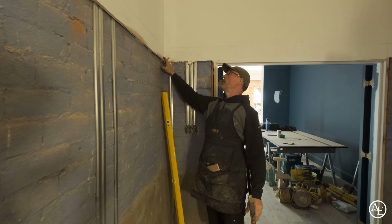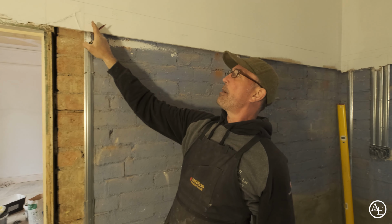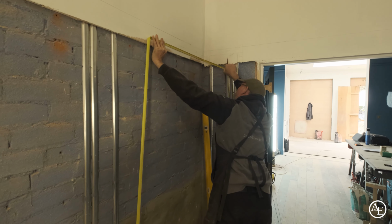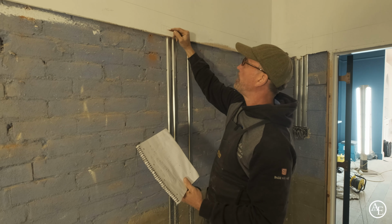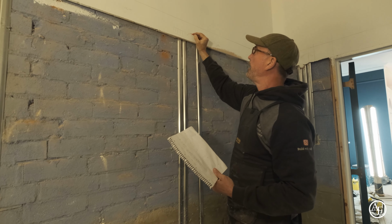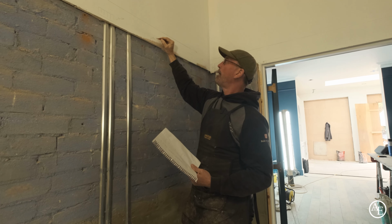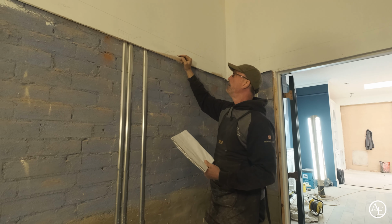Mark my 50mm line on this side here. I've marked my 50mm line on this side of this architrave here. I'm now gonna make a measurement, a side of 50mm. Right, that's actually a measurement there of 2086. I need to make sure I've got five panels. There's two, three, four, so there's five. Four times 50 equals 200mm this time, isn't it? So the measurement I've got, 2086, I'm gonna now minus 200mm off that and then divide it by five, okay?